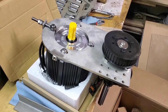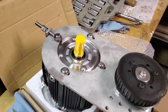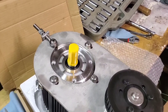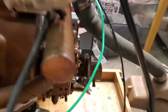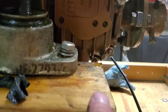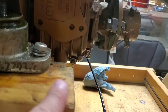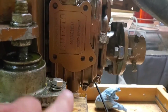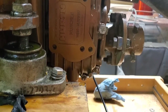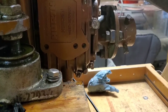I'm going to finish putting this together and put the pulley on and the timing belt. I just measured this dimension — luckily I have my motor here. I measured on the existing motor the distance from the center of the shaft to the motor mount. The center of the shaft is actually three quarters of an inch above the motor mount. I didn't move the engine or the mounts at all. So I know exactly what the drop — or in this case the rise — needs to be to connect right to my propeller shaft.